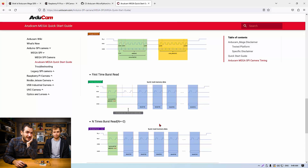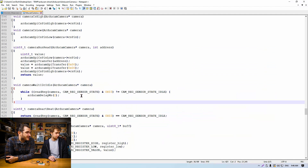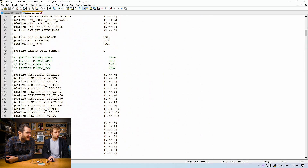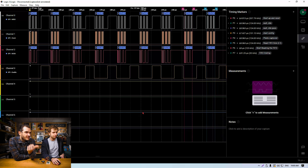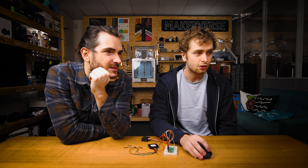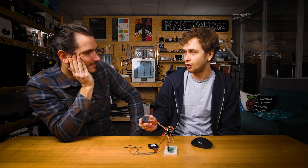It can be a bit of a trap to cruise past the timing diagrams, especially when you've got some experience and maybe get a little lazy. The register meanings are in the data sheet, but even the Arduino code is the best reference because that's what's really going on — all those registers have basically just been ported across into MicroPython. So once we initialize the camera, what do we do to read an image? We're ready — there it is! It's changed to 0x2626. We've got a photo. We know there's something on the camera, but we need to know how big it is using the X/Y dimensions.